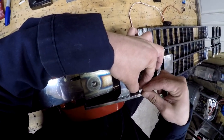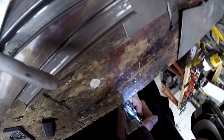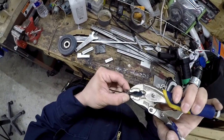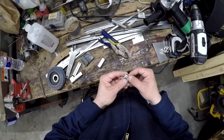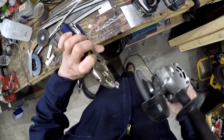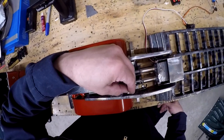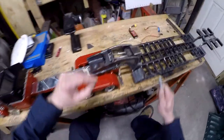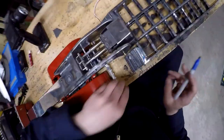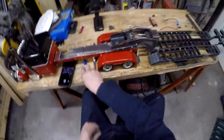I want it to be almost as close to this bracket as it could possibly be. Now that the spring is tightly in place, we can probably get rid of some of this excess material. I want it mounted so it's pushing all the way up with a little bit of force. Let's mark some holes and then we'll drill it — approximately those two spots.